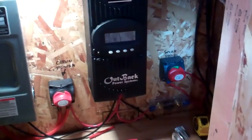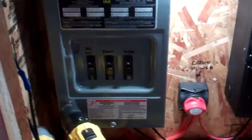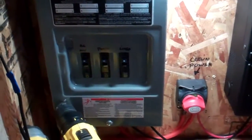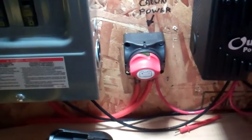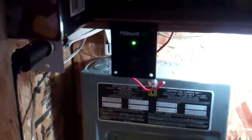So what we've got here: the cables from the solar panels feed into the Outback — that's a FlexMax 60. To the right side of that I've got a solar panel disconnect switch and an inline fuse. On the left side I've got some Square D QO series breakers, which are good for off-grid because they're rated up to 48 volts DC. Next to that I've got a disconnect switch. Those disconnect switches and inline fuses you can find on Amazon pretty cheap. Right here I have a remote switch that turns on the 2000-watt inverter mounted down by the batteries. I also have my old 600-watt inverter that I leave hooked up for the TV and stuff like that.